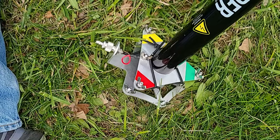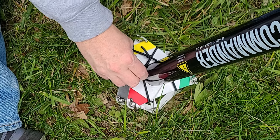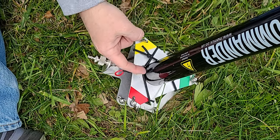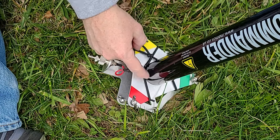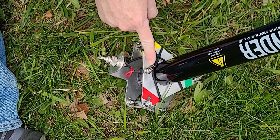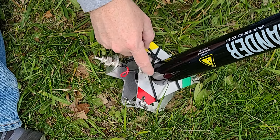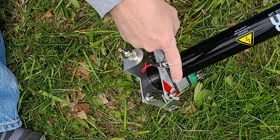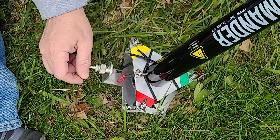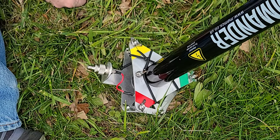The last two little tidbits are right here on the bottom of the antenna. Tidbit number one is this particular wing nut is just a little bit too big. It actually runs into the pole when you try to tighten it or loosen it. So take your Dremel tool or your grinding wheel or your file or whatever, find a rock, and rub the sides of this thing down. I don't know if you can tell that it's significantly smaller than the other wing nuts, but that frees it up so that it'll spin nicely and makes attaching your main driven wire a whole lot simpler.